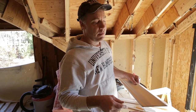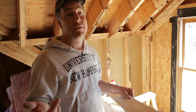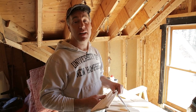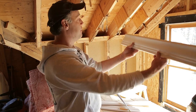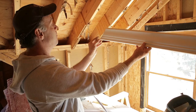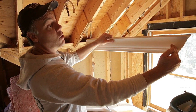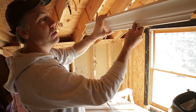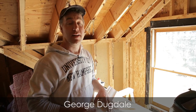The last piece will either end on an outside corner, which is convenient, or if it's on an inside corner you'll be doing a double cope — both the left side and the right side coped. You measure from one coped end to the other, snap it into place, and it should fit perfectly. And that's all there is to it.